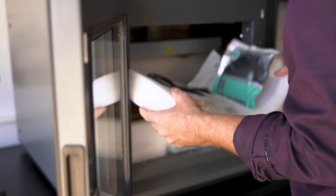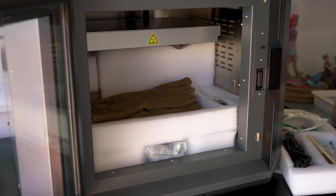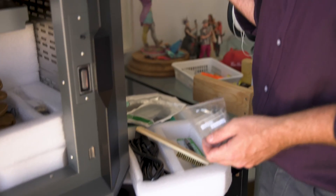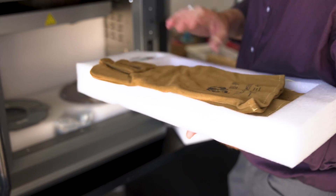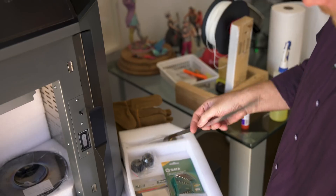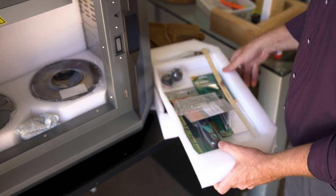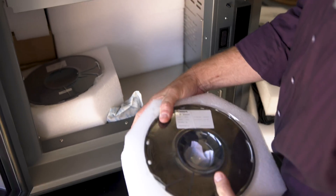In the kit we have a power cable, an ethernet cable, a brush, some hardened steel nozzles including a couple of spare ones in different varieties, spare fuses — always good to have. When you have a hot machine you need gloves — great thermal gloves included. There's a little set of tools, a leveling shim, and some cleaning tools. Acupuncture needles work great for cleaning a 0.3 or 0.4 nozzle tip.